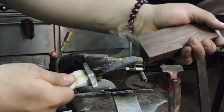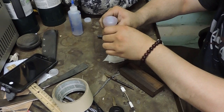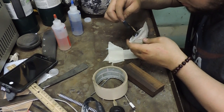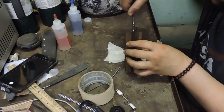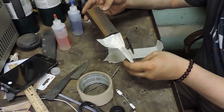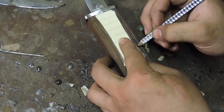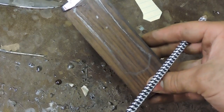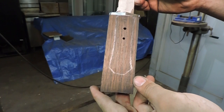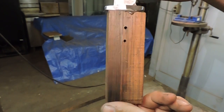Alright, so in there pretty good. Now I've got the pieces fit together, so I'm going to take some two-part epoxy and get as much glue as I can in the seam. It should be in there pretty tight. Now I'm going to sit and let this dry and then we'll drill the pins. The bottom one is drilled in fine, but I guess I didn't properly normalize the tang and it will not let the drill bits through — I've tried four different drill bits and none of them will drill through the tang.